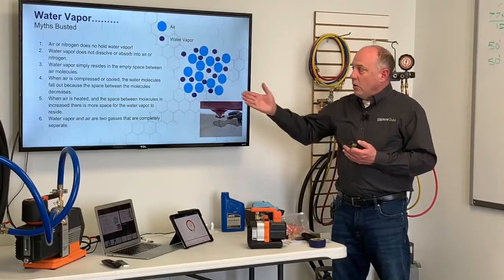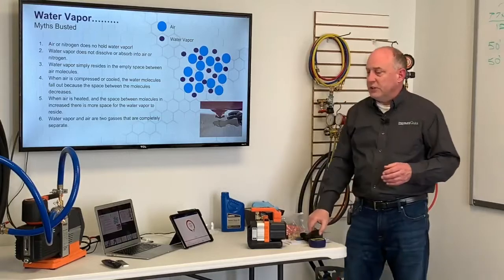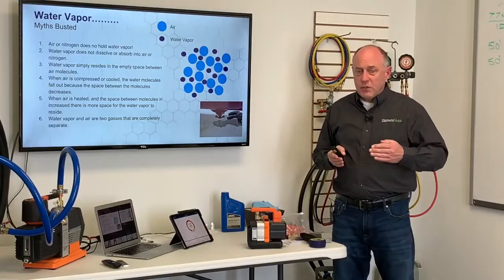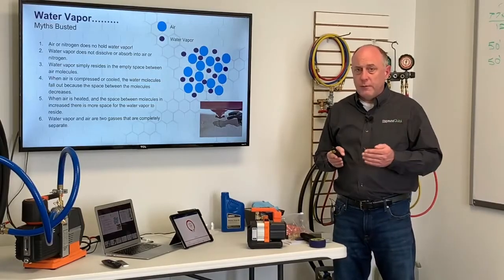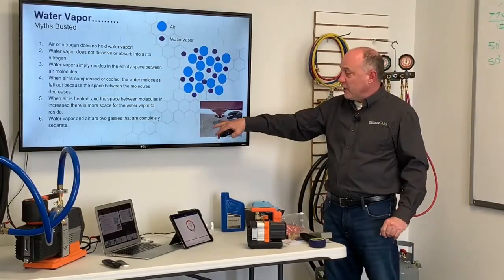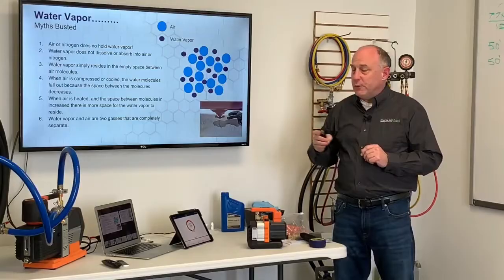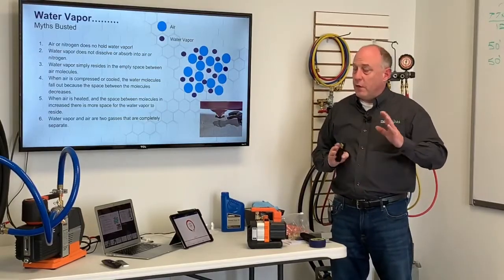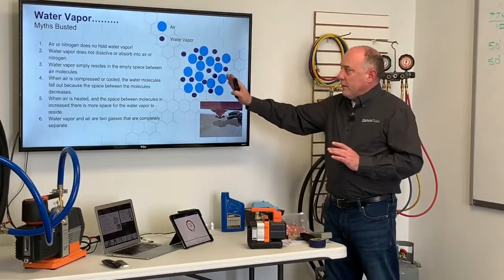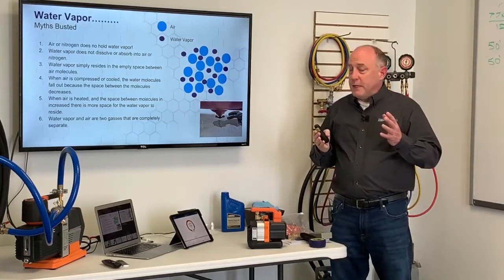Now, we talked about also when air is compressed or cooled, the water molecules fall out because of the space between the molecules. This goes back to what I was telling you earlier, first part of the video, vent or sweep the system with nitrogen before you pressurize it. If there's a bubble of atmosphere inside that tubing and we can press it down, right? It's just like this air compressor here. The water, the liquid will go from a vapor, it'll drop out in liquid. Once we get liquid in the system, it takes forever to remove. So we want to avoid that at all costs, okay? So very, very important to do nitrogen sweep first. And then again, the only thing that water molecules can do is as a vapor, occupy the empty space between the nitrogen molecules.